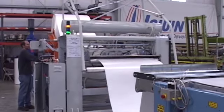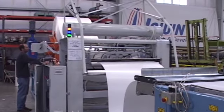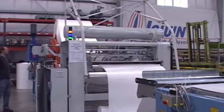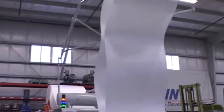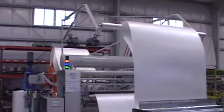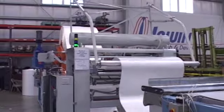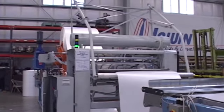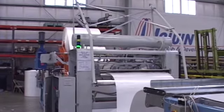We're going to show it on the exit side. You're going to see the accumulator arm go up as the sheet feeds an excess amount of sheet out, and it'll come down. In the meantime, the splice is happening right now. It reverses, throws off the excess scrap. It'll come back forward again and you'll see a short piece of scrap from the new roll that was cut off where it joined the old to the new.